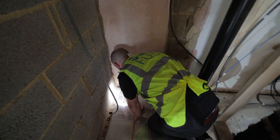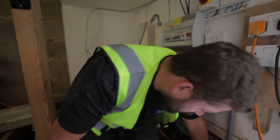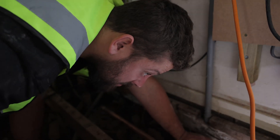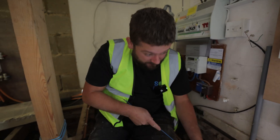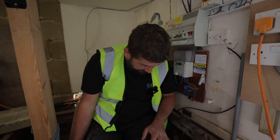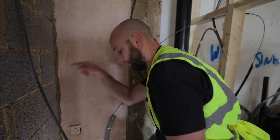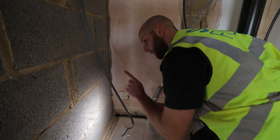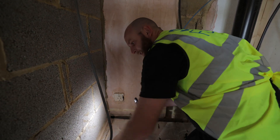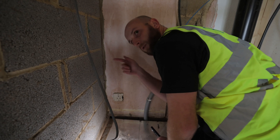The arm was through but I think with the flex on the side it's getting snagged. The issue we've got is we've got a little knee wall — little brick walls underneath here that pick up the floor joists. We've got one here and there's another one over there. We can potentially drill them but it might be quite hard to drill them and get the rods through both ends.